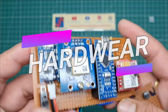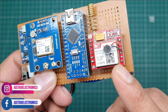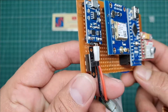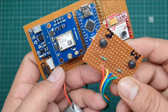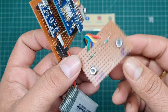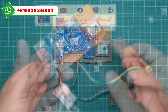This is the hardware of the project. I designed it very small and placed all components on a zero PCB. It includes the Arduino Nano, NEO-6M GPS module, SIM800L GSM module, TP4056 battery charger, a boost converter, a sliding switch, and two push buttons with 10k resistors. Pressing the first button sends an SMS; pressing the second button makes the GSM call. To recharge the battery, just plug in a USB cable.